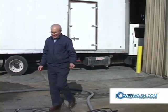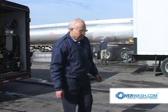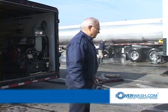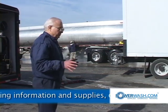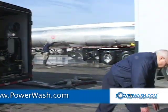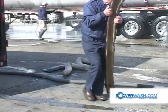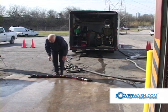Just like a mechanic with a toolbox full of tools — basically, wash water recovery is about not putting anything down into the storm drain. The vacuum sludge filtering system hooked up to the surface cleaner is one way to accomplish that. Another way is a vacuum boom, where you'd use a regular surface cleaner to run the water down to it, then through an oil absorbent boom and into a vacuum boom. Normally you're going to want to channel the water down to a narrow area to pick it up.